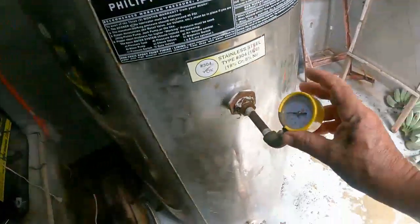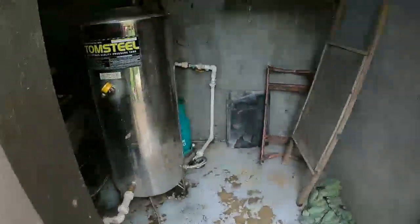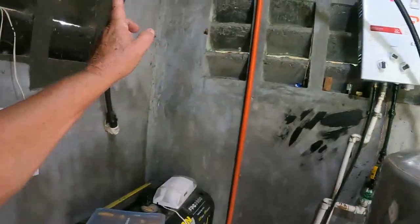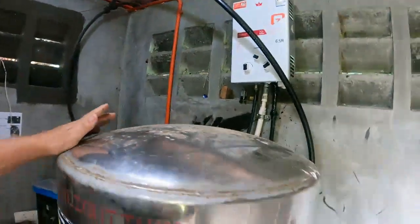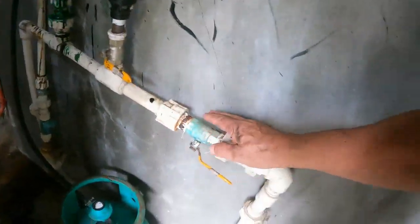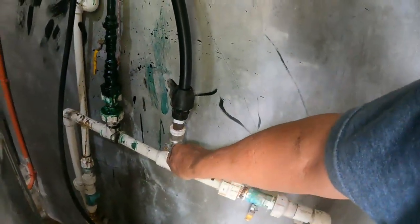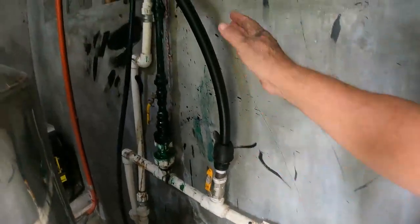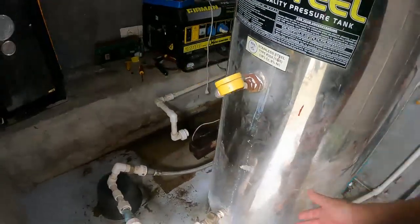This is the second one I have to replace as well. While this is happening we've still got full water to the house. The 12-volt system originally came in here, went to the washing machine for rainwater. I just broke into it up here and fed it back into the inlet side. This is the tank here and this is the 12-volt here. I turn this one off and go back to 12-volt, so if they turn on the tap inside, the 12-volt under pressure will come on and we've got water.